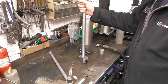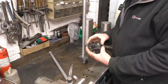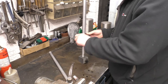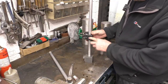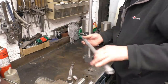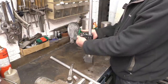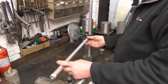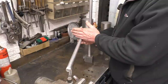This is quite a strong, quite a sturdy affair. It's certainly going to be strong enough just to rest my arm on. Next thing I've found is one of these made by Manfrotto - it clamps. I've got a few of them. They're used for clamping, putting lights on or clamping cameras - really handy, they get a very good hold. On the bottom I've got various threads, the first one's 1/4 inch UNC and I think they're 6mm. I could probably drill and tap one of those out and just screw that into there. It fits but it's not really stable enough for what I want. We'll change the threads in there to 8mm and give it a try. I'll probably end up putting a plate on here that moves.